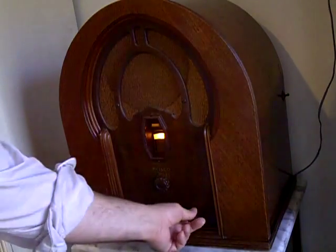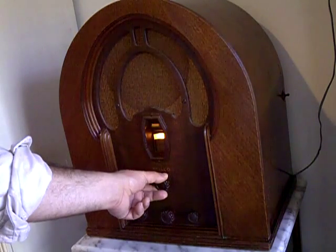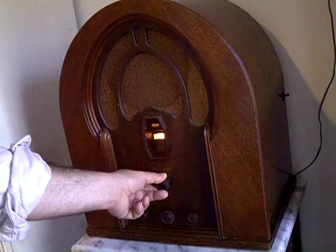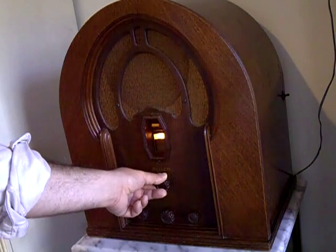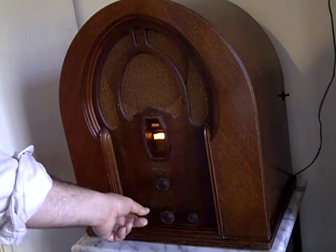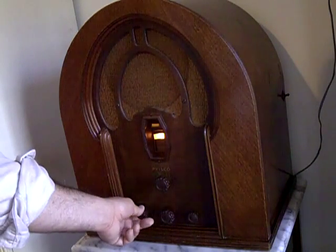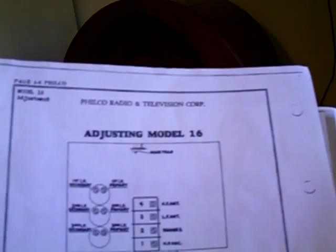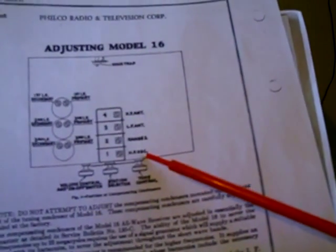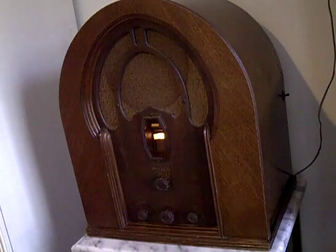What I did was set the radio to 10 MHz and tried to get WWV. It's coming in kind of faint — it's not the right time of day for 10 MHz. So I set section 1 of the compensating capacitor on the tuning condenser to 10 MHz, so I knew at least one thing on the radio was right.